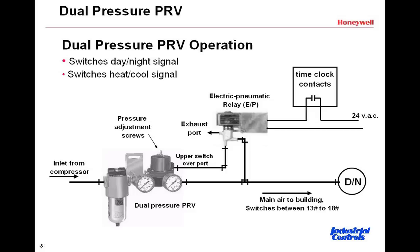You've probably also seen manual switches for summer or winter fuel systems — a lot of different ways that could be set up to operate. It's important to note that when talking about a dual-pressure main, we're only going to switch between day-night or summer-winter or heating and cooling. It's not a system that can do day-night and heat-cool simultaneously. We'll learn that later with the thermostats and other devices that this air supply serves.